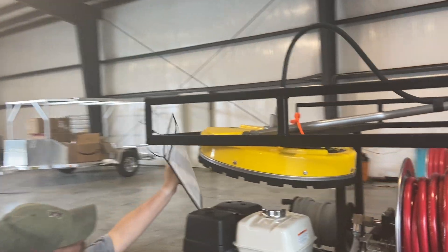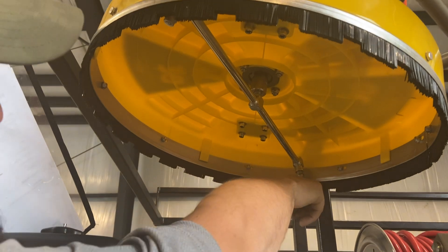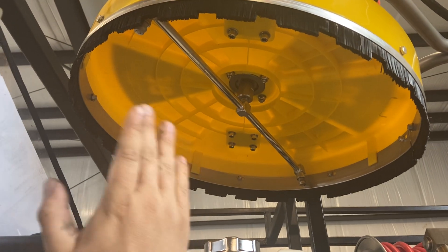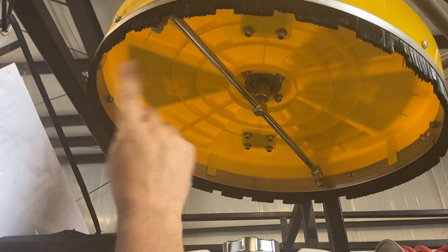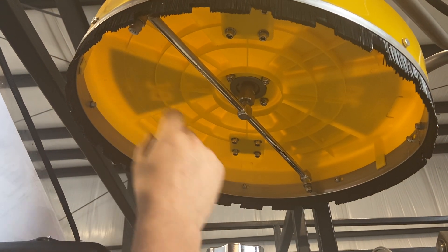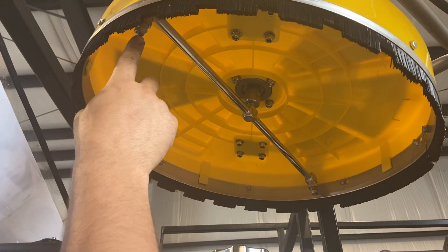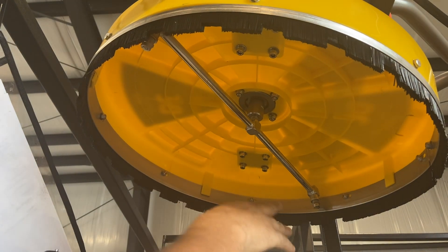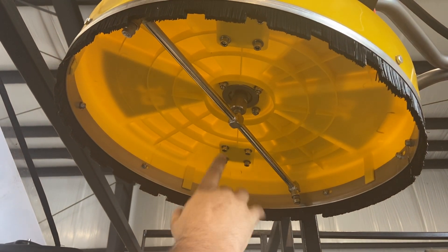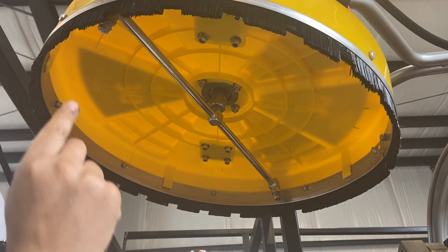Here is your spray bar. Inside the spray bar, we've got a tip on each end. These tips, if they get clogged, they're going to give you trouble — you're not going to get a good clean action out of the surface cleaner. Easy fix. You basically take this tip out, spin it counterclockwise — they just screw right in — and clean it out. What I like to do is just hold it up to the light and see if there's any trash in there. Another thing you can do is cut the pressure washer off, allow the garden hose to continue flowing, and look at the spray pattern. Tip the thing over on its side and see if you've got a nice pretty spray pattern coming out of both of these. Whichever one is clogged is going to have a janky looking spray pattern — that'll help you identify which one you need to clean out. Normally when we get a clogged tip, I just go ahead and take both of them off. I'll clean out the one that's clogged with a needle or something real small.